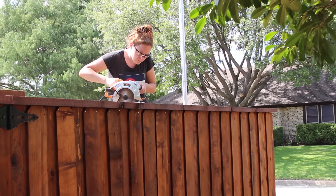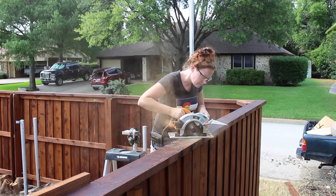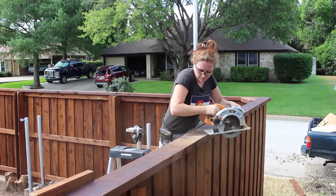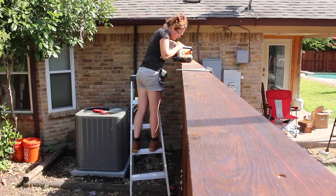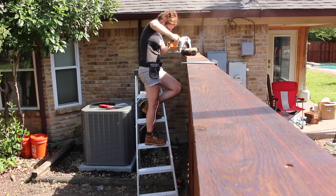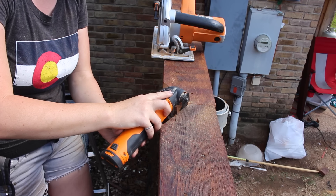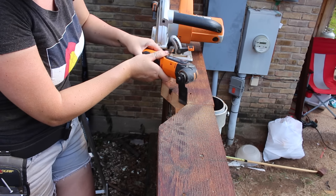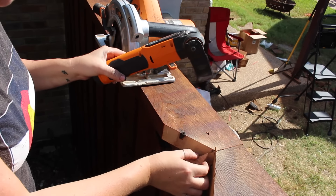At this point, the gate is still just one solid wall. So I moved up to the top with the circular saw and made one diagonal cut in order to break it loose. Even with that cut done, the gate still won't open freely because the top cap interferes. So two relief cuts on the hinge side need to be made so it has the ability to swing all the way open. I used a circular saw to cut out the bulk of the material for these relief cuts, then used my multi-tool to cut out the remainder.